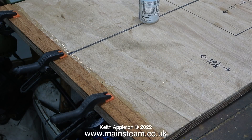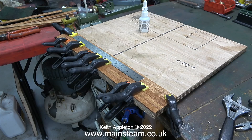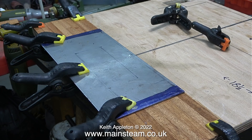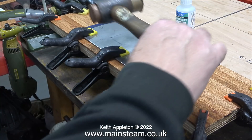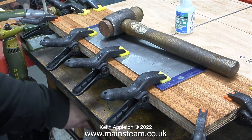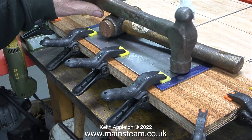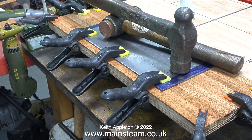If you're following this series, you'll know I've already done this job once, but unfortunately the wood I used for the baseboard warped. This shouldn't warp as it's nine-ply 18mm plywood. I'm enlisting the help of the steel plate that's going to be the boiler base, using it as an extension to the spring clamps to make sure the mahogany strips are all flat on the baseboard. I did this job in stages, and put some heavy hammers on top of the steel plate because I really didn't want the mahogany strips to lift.